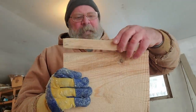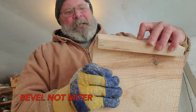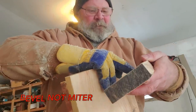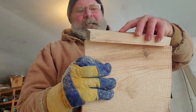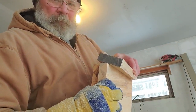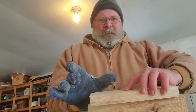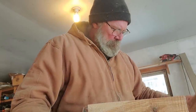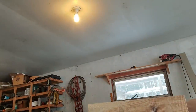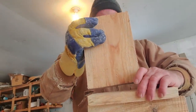And then we got a rain cap that I got to still put a miter on. We'll do about a 5-degree miter, and then do a rain drip cut on the bottom side. So that'll act something similar to this. And then our next course of siding will come down like this.